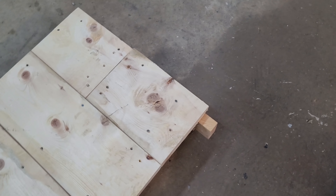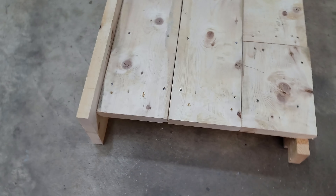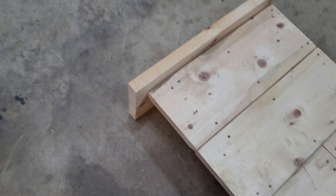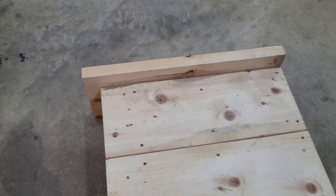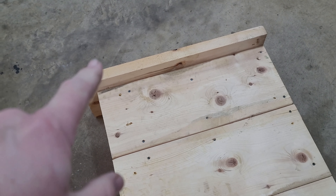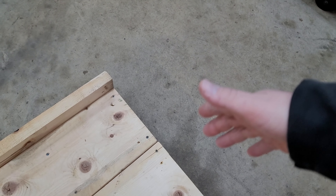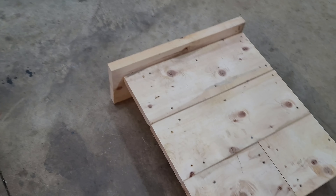This kind of jets out because it's got to go between the brackets on the overhead door track. I left the one side long — I wasn't sure how I was going to attach that stainless cable to support it, so I just left it long. I can always run a circular saw down it and make it flush. I used the larger piece of wood on that side because that side is going to have more stress on it being hung from a cable, since it's going to be screwed to the wall back here. There's going to be a support board that runs vertical to hold the back to the wall, so that corner is really going to be the only part that needs to be super strong.